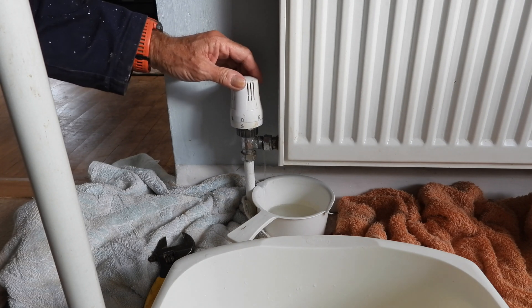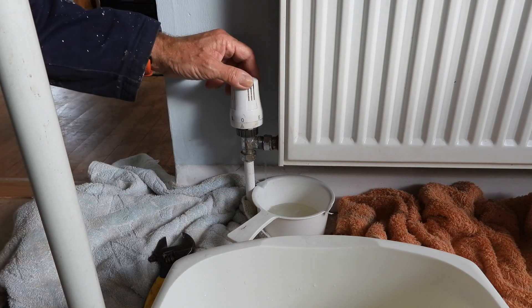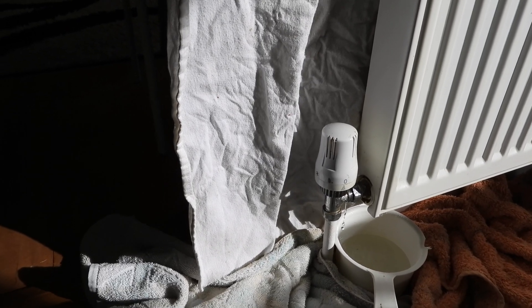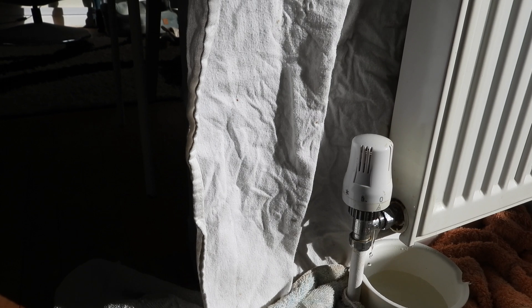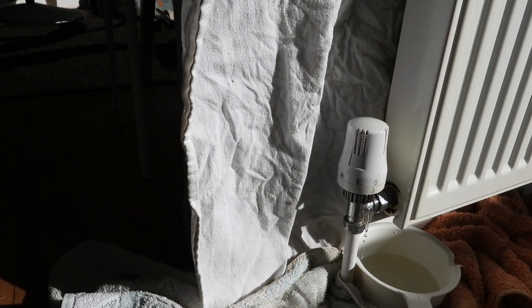A little radiator like this one only takes about five to ten minutes to empty. We're nearly there now. If you've got wallpaper on the back wall behind the valve, I always tape up a little bit of cloth there — because if you get any black sludge flying up, it will stain the wallpaper and it's impossible to get off. That's why you should pull carpets back out of the way as well.